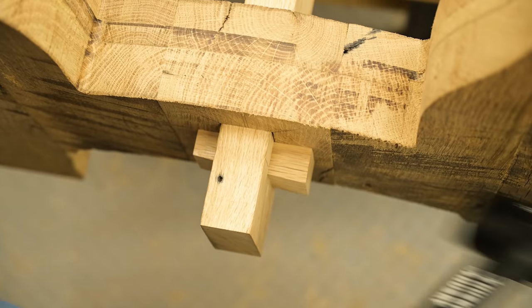On to the fun part. We have some defects, holes and stuff in the wood that we're going to fill with some tinted epoxy. Kind of wanted a custom mix, so I pre-mixed my proprietary blend of pigment here, so that when we get to the top, which you're going to do later, I'll have some pre-mix left over if I don't use this all. So yeah, using Total Boat High Performance 2:1, again, for the set time.